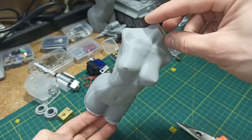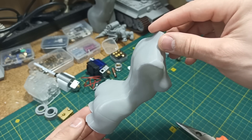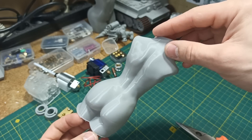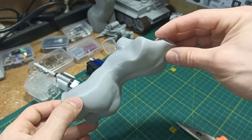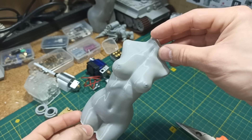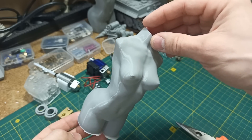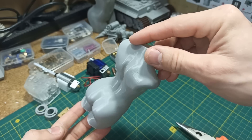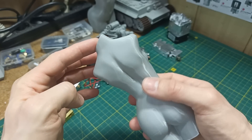And here, please — our figure is completely ready. Layers laid down very beautifully. The aerospace hotend with ceramics handled the silk PLA perfectly. Here, pay attention, there is a small stripe from a temperature change — I tried to increase the temperature slightly through the printer menu. By the way, I don't recommend doing this during printing — when you change via the menu, small artifacts can appear on the model. But overall, the part turned out very beautiful.